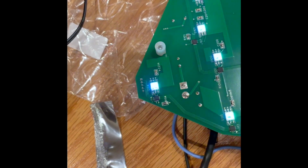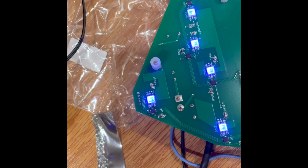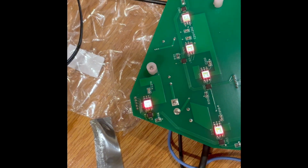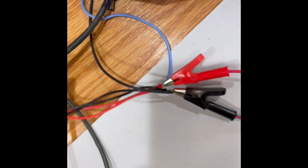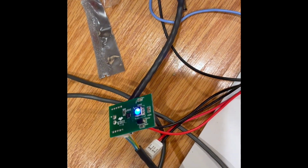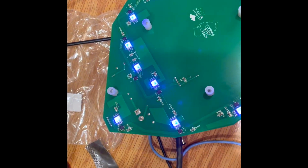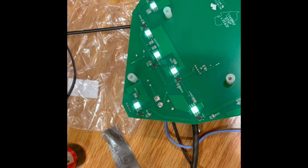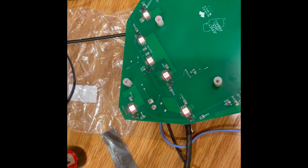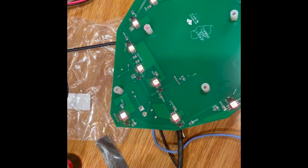That's good news. Now I've got to test the output of that Allegro chip, so I've got to replace the connector now, and then I'll hook the fish board up to the Arduino and put this single LED on the output of the fish, just to make sure that both the input and the output work on that Allegro chip. And once I'm satisfied with that, then I'll put the output buffer board on the fish and put it back in the machine.